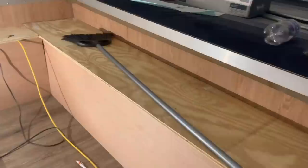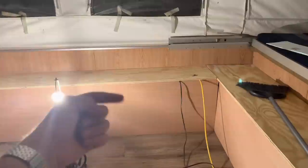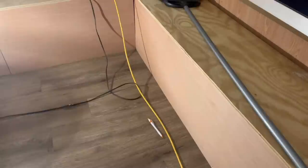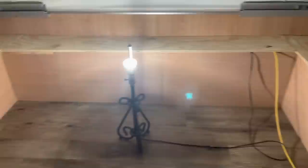The tops of the boxes are made and Cody went ahead and put the paneling up all the way — it's pretty much all up. This one piece I'm actually going to put magnets on the back of so you can just pull it off to access the breaker box. I still need to go through and cut boxes for the outlets. I'm going to add one on each side of the beds — a USB receptacle so you can plug your phone directly in without needing a standard wall outlet. Getting a little tired so we're calling it tonight.